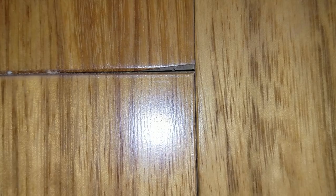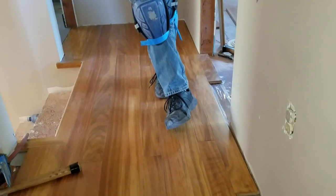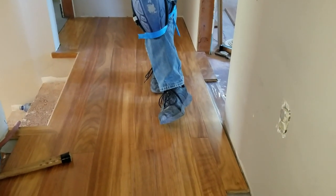One of our favorites is this one here — just the machining of the wood. Somebody at the factory got it out. And then you see we have slightly different widths of wood. If you do real wood floors you can sand it out and putty it and everything looks flat and smooth. When you do a pre-finished floor you're just stuck with it, at the mercy of how well they machined it in the factory.